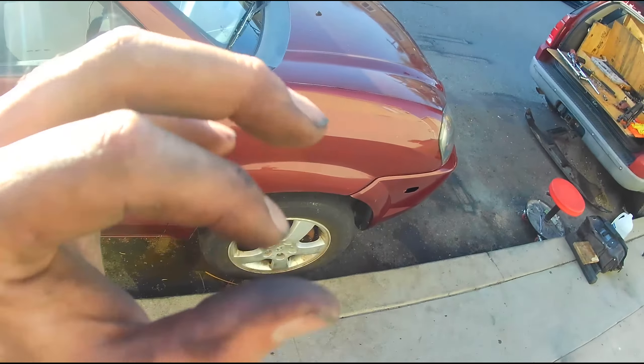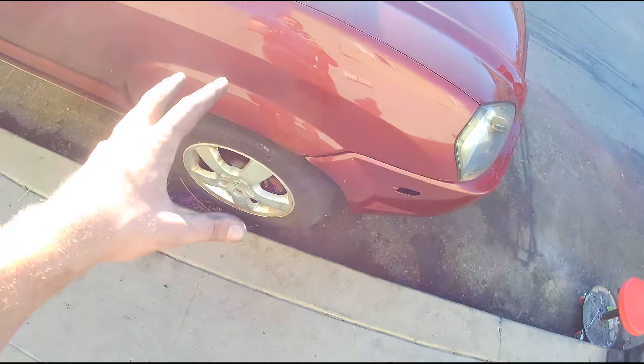I got it pretty tight when I did it, but I did think most likely that'll be a problem in the future. So with all that said, I'm going to push the air through. If I can find the leaks, I'm going to circle them with a sharpie, then clean it up with a wire brush, and then grab the welder and spot weld those up. That's my goal. See you guys in a bit.